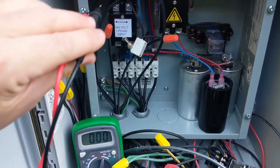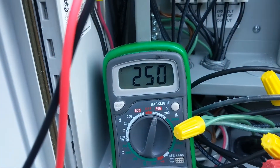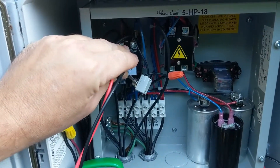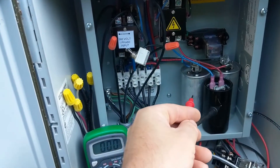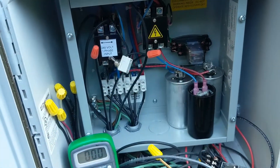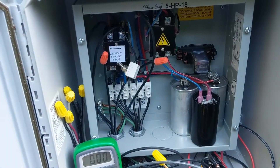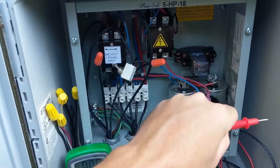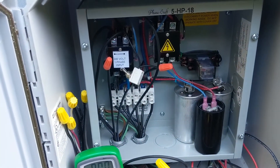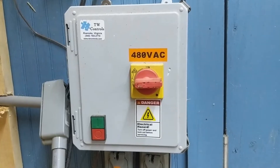With this turned off, we have power from our double pole breaker — just like you would have in your house — coming to the top of this contactor right here. We have about 250 volt AC single phase going to it. When we start this thing, it's going to pull in this contactor, it's going to power our idler. And then this starting capacitor right here is going to be engaged until this relay pulls in. I'm going to leave the camera going while I go turn this on, so hopefully we can catch that timing. Then after it starts running, this drops out. And these run capacitors are used to balance the voltage between our three legs of power. I have a remote start for all of this inside, so I'll set the camera here so you can see what's going on.